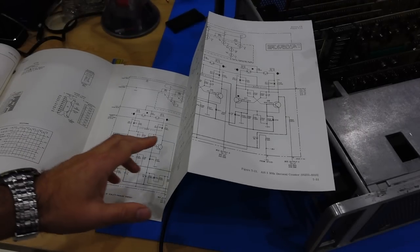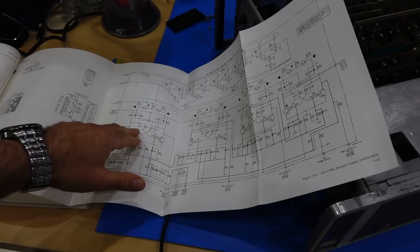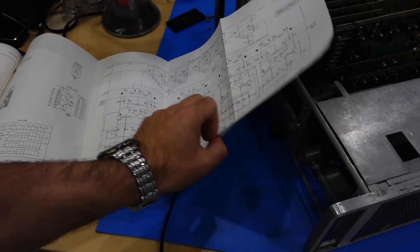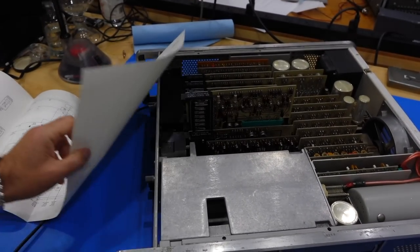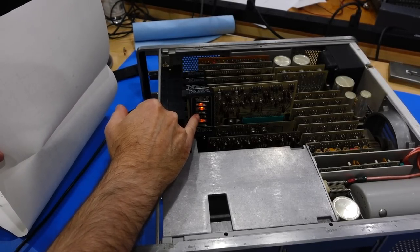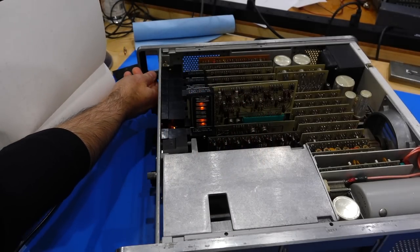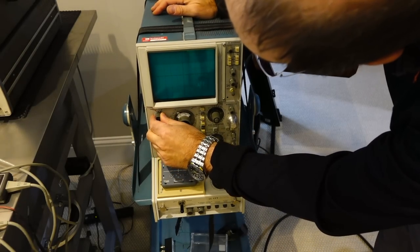So after studying the hieroglyphics, the flip-flops are in order A, B, D, C. And I think it's the D that's not working. The third one is not even resetting in the correct position. So if I go here, this one should be inverted here. So it's the third pair that has one of the transistors that's bad or one of the diodes that's bad. That's my guess. Resistor check for the flip-flop PNP this time.